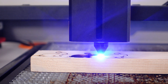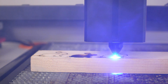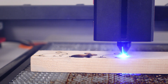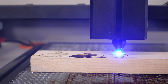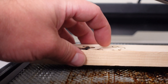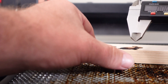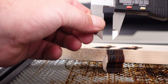So what could I do with this laser that I couldn't do with others? For instance, cutting 6 mm MDF in one pass, or 9 mm MDF in two passes, or cutting 18 mm of birch wood in two passes. Plus, the air compressor used for the air assist unit keeps the cuts clean, preventing charring or burning. The cuts look remarkably clean.